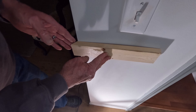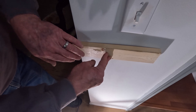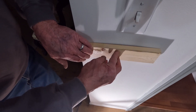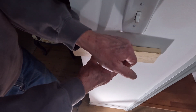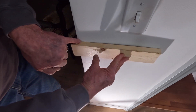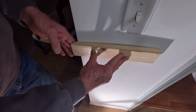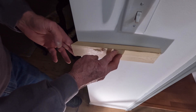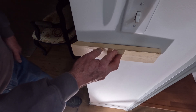The next thing that happens is even if we do get a good angle, sometimes we nail the trim here, then push it in and nail it tight here. You don't want to push the trim in. You want to nail the trim on the high spots and leave that gap. When you're all done, come back through and caulk it — no one will ever know the difference and it's going to leave your corner tight. Because if you push the trim in tight to the wall, it is going to change your angle over here and open it up because the angle is no longer correct.